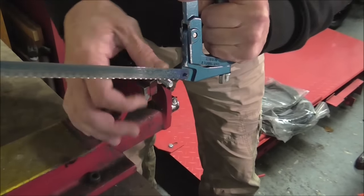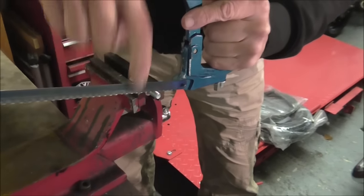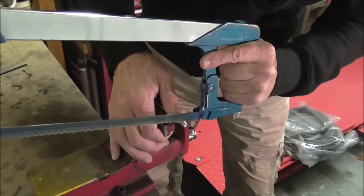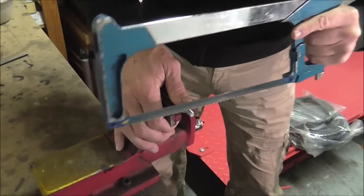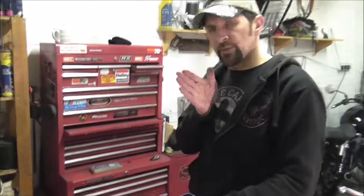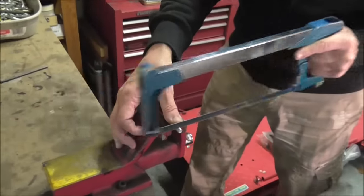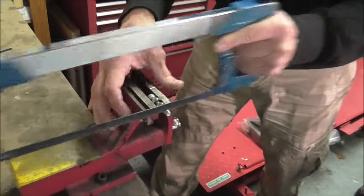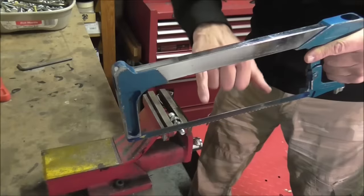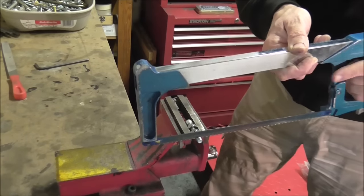Draw backwards to start with. Find one of the little threads to lay the blade in, and holding it with your thumb in one place, just draw backwards with nothing more than the weight of the blade — just the weight of the saw. Don't press downwards, just the weight of the saw. You'll get a little groove made. Go backwards and forwards with the weight of the saw. Don't wrench down on it, don't hack into it, because you'll just make a horrible end on the bolt. Give a nice backwards and forwards stroke — literally just glide the saw backwards and forwards. Use the full length of the blade, holding your thumb in place until it's got a little groove to lay in.